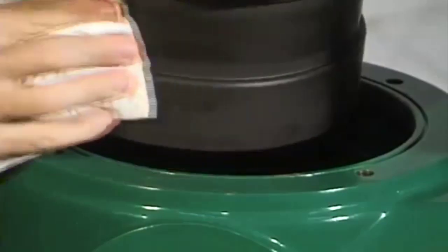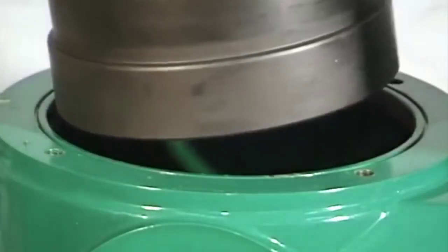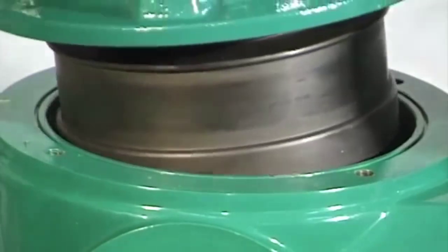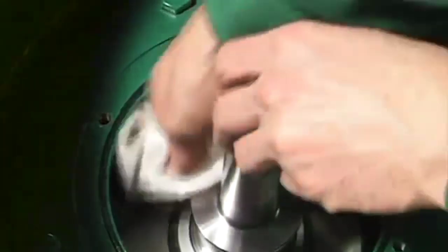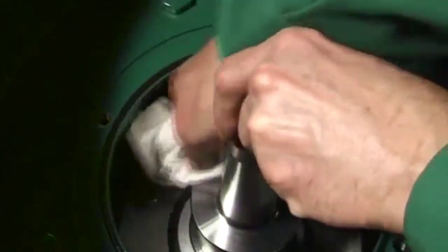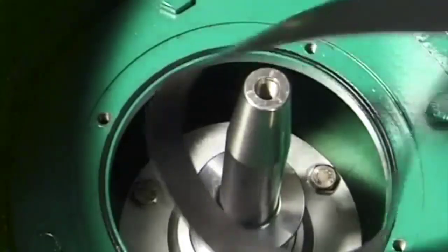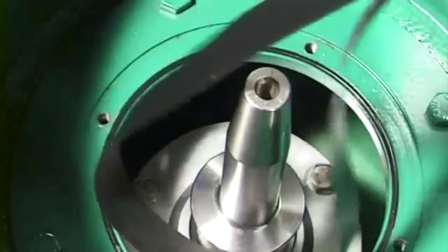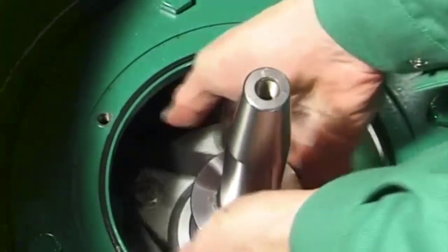Carefully place the motor with pre-assembled centrifugal clutch on the lower section of the frame by means of a hoist. Do not yet let the motor flange lock into the frame opening. Remove the grease from the belt running surfaces of the spindle and clutch drum. Mount the drive belt through the opening in the upper section of the frame and through the brake housing opening, centrifugal clutch.